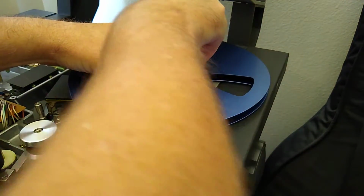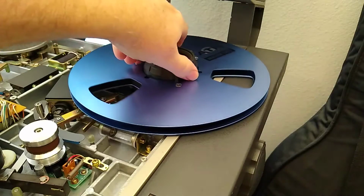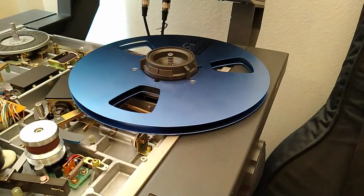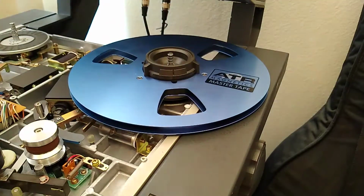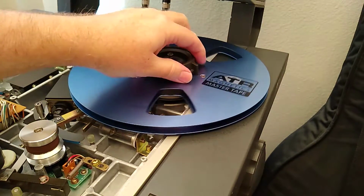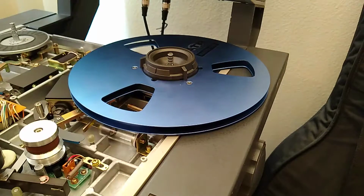And put the reel back on, and that's going to give you a little more lift up, a little more clearance on that. So that's obviously something that they've already had trouble with in the past. So I'll just keep that thing nearby in case that happens to me too. But anyways, that's what I said. Let's move on to actually adjusting the tension on the reel brakes here.